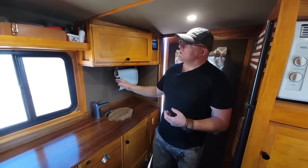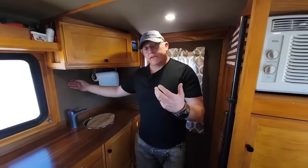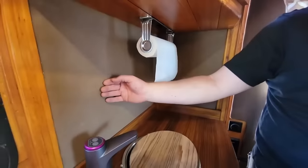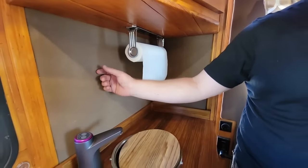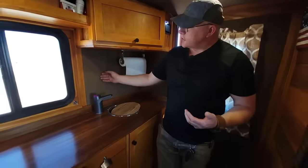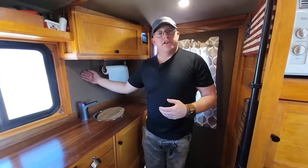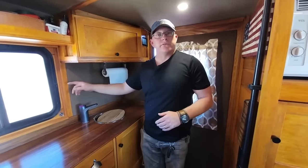So I think one final thing I want to mention about the build in here is going back to the insulation. If you guys notice here, this wall surface is actually just EPS, or expanded polystyrene, 2 inches thick foam board. You could buy it right there at Lowe's or Home Depot. And I took a fabric, in this case duck, and I used an adhesive and actually wrapped the insulation with this fabric and then put it in between the wall spacers of the structure.